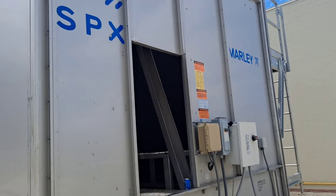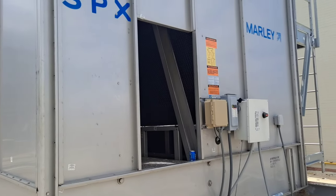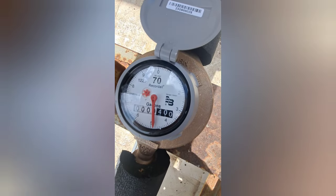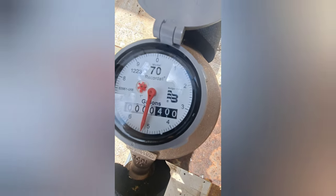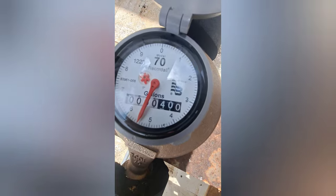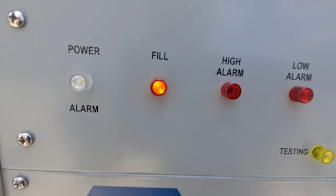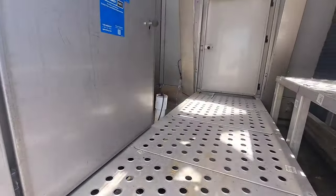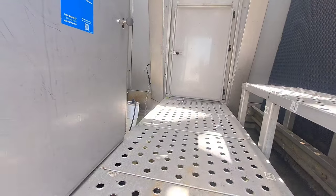This is a Marley. But as you can see from what I've shot so far, we're getting her filled up, get her turned back on and everything will be right again. The cooling tower is finally done, or close enough — I'd say it's 98%. We're at 400 gallons so far. Waiting now for that fill light to go out. I want to get a little bit more water in the basin before I turn on the condenser pumps and then get the chiller going.